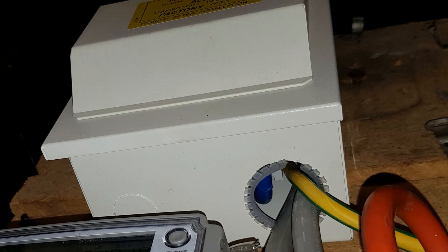The best thing for this situation is the gland because it holds the tails in place. I think possibly that wasn't done because of the constraints of the space below - you can see the meter is situated below it. But I would say definitely use a bushing and lock ring provided that it's not possible to get a finger in there.